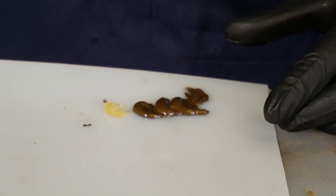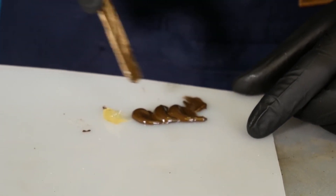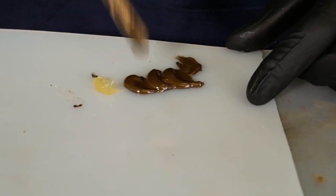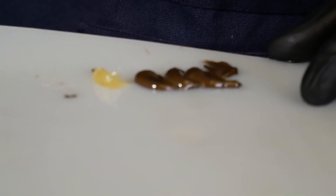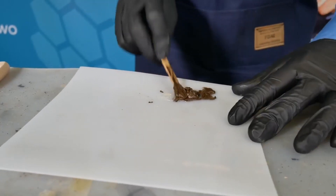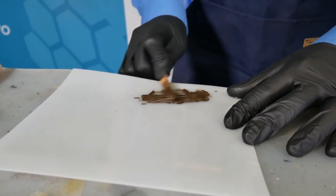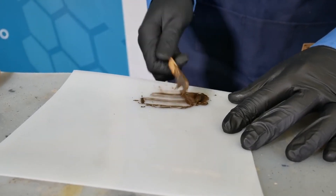This is typical for epoxy or dual composite glues. Make sure the proportions when mixing are as equal to the specified ratio as possible. If you want to be extra precise, use a scale, but the visual application method is sufficient for the glue to work. In dense glues it is more effective to spread the two compositions against each other rather than stirring.